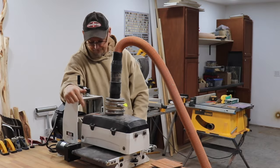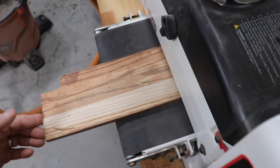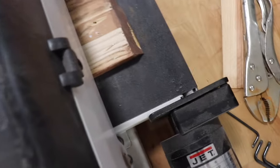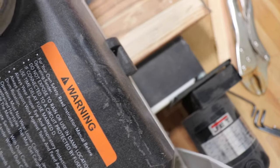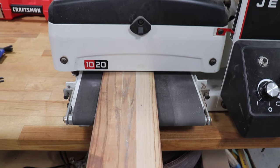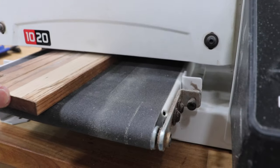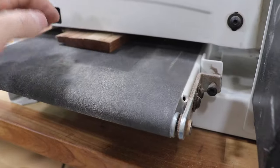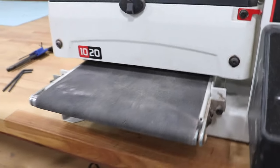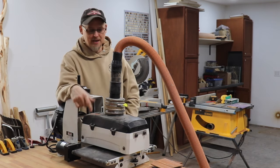I did this piece and this piece, then started trying to do the third piece — and now the machine is stopping again. It's not the shaft keyway broken this time because it will spin every now and then. But as I start to feed material through, the belt pauses, the shaft isn't spinning the belt consistently. I've got a vacuum on it now so I'm not getting sawdust jammed inside the machine, and I blew it clean. Since we reassembled it we only ran a couple of pieces of two-by-four through it — maybe four to six passes — just to confirm it was working.